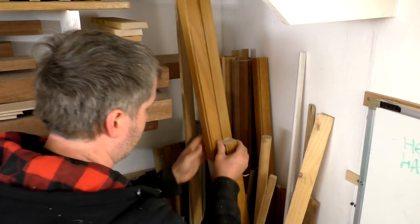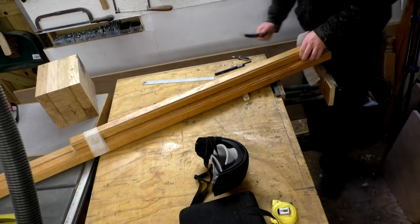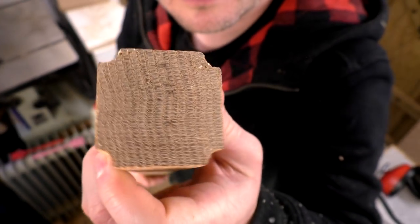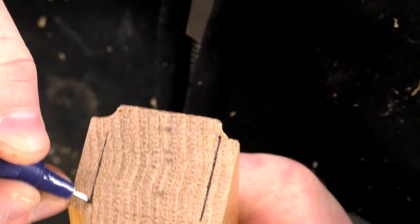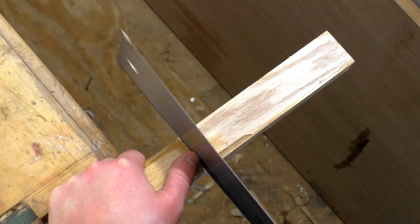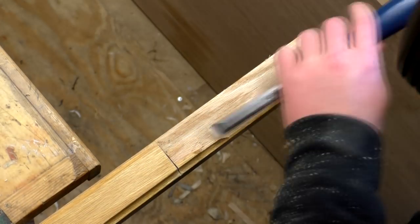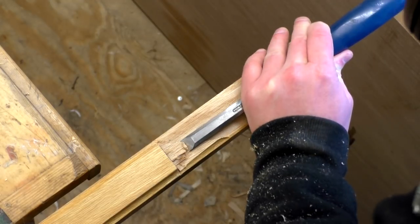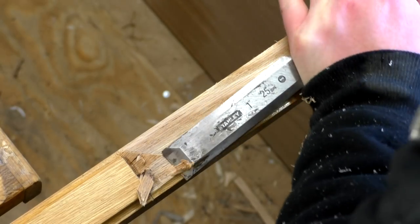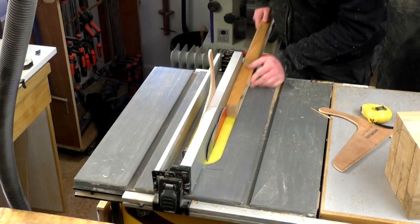Next I looked for a piece of oak to use for the handle. I had a few 50mm by 50mm pieces which were the upright pieces from some reclaimed hat and coat stands. These pieces had a cove on each corner, so I marked up some cuts to get rid of the coves where the handle would be joined to the head. I made the rip cut on the table saw and then did the cross cut with a pull saw, removing the rest of the material with a chisel to form the joint, and did the same on the opposite side too.